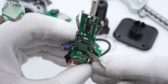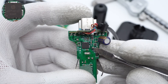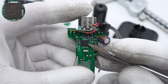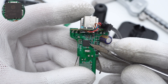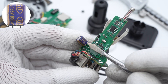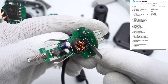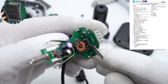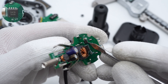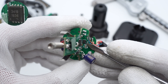The synchronous buck converter is on the other side, covered with poly paper for insulation. It's from DeepPool and supports 38V input and 6A current. It also integrates a 14mΩ synchronous buck MOSFET. The output filter capacitor is 100μF 35V. The protocol chip is from Wind Semiconductor, XPD977, used to control three USB ports. Two MOSFETs are on two sides of the small PCB, marked with 3419, and used for the two USB-A ports.